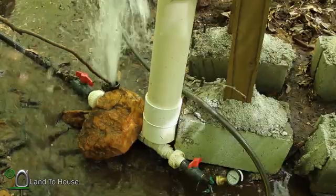I just pulled the gauge off the pump and I'm going to take it up to the delivery end to see what the pressure is up there. We were getting 20 psi down at the pump. Up top there's a sprayer on mist coming straight from the ram pump. So let's put this gauge on here — we're at 15 psi right now. I wonder if the loss in psi is due to the vertical distance the delivery pipe is traveling. So we lost 5 psi to get to this height from down below.